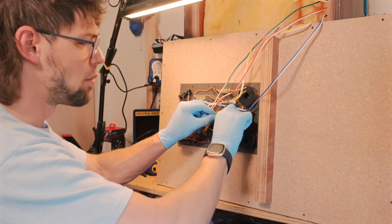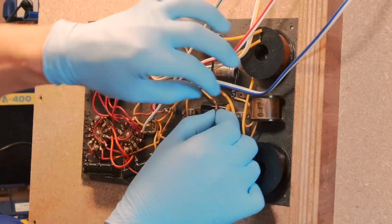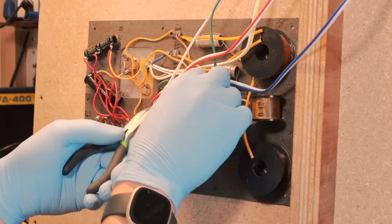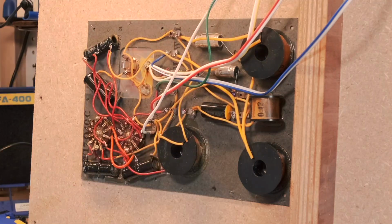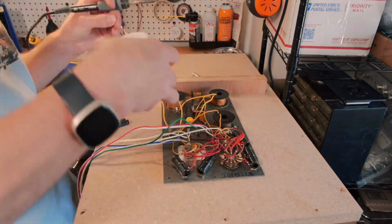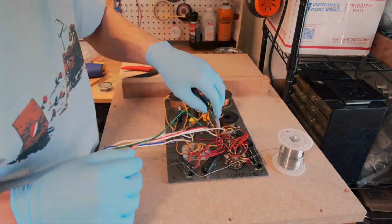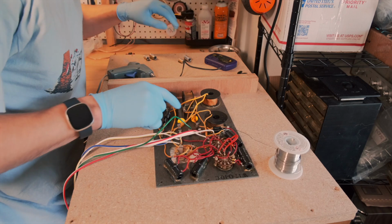To install the new capacitor, I wrapped the leads around both posts, then cut off any excess wire. I also reused the insulator on the left side lead from the old capacitor. I then used pliers to crimp down the leads around the post and applied a liberal amount of solder until the leads were fully submersed. You never want to use only solder to hold a capacitor in place, as it can crack or come loose from the speaker vibrations. Alrighty, so I finished putting these capacitors in.